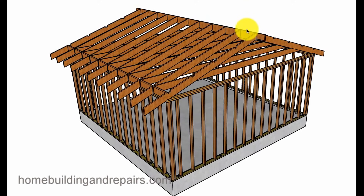For the roof framing, you're going to have a ridge. I used 2 by 6 rafters with a 2 by 8 ridge, and the ends will need to be notched. The rafters on the end will be notched for the outlookers. Gable studs are 16 inches on center — I like to have one underneath the ridge going all the way down. If you're going to put a gable vent in, put it off to the side, or if you want it centered, just frame accordingly. Gable vents allow air to circulate into the garage ceiling, and you may need additional vents as required by code.